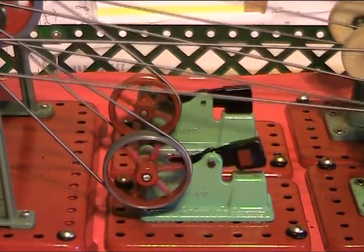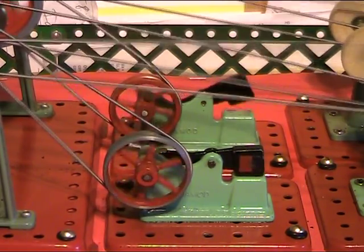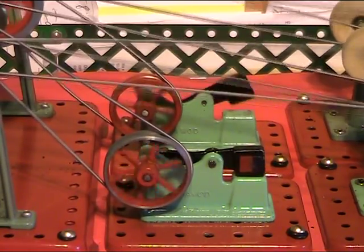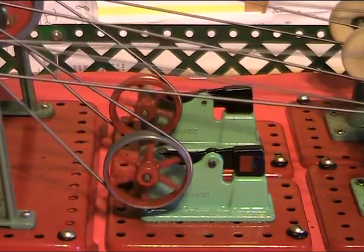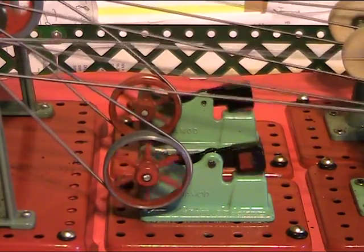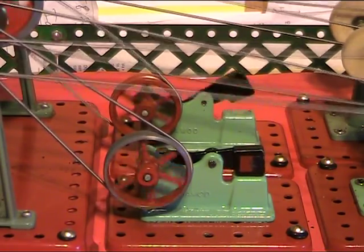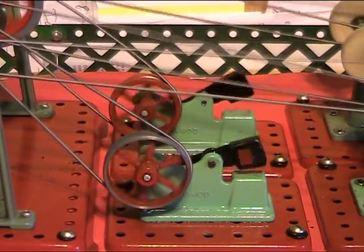There's the two hammers. As you can see, the one with a smaller flywheel seems to be running almost about twice as fast. But it is being run off, you can't see on here, the pulley the same size as that, which is probably, I don't know, 3/4 inch at a guess. The Meccano pulley there is 1/2 inch. So the ratio is closer on that one, but still, you can see the band's slightly slack, it's still got enough drive, no problem at all there.